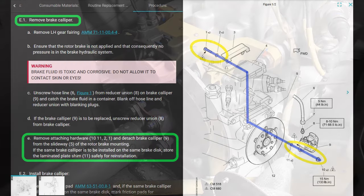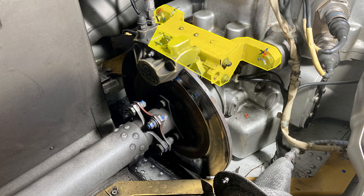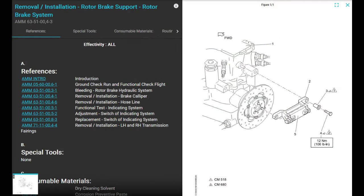So what you got to do instead of that is you just have to take off the support. That's way easy, okay? It's just the 2 bolts that hold the support into the transmission. 2 bolts with bushing. There's 2 bolts that hold 2 bushings into the transmission. So you just disconnect those. So now we have to go to a different chapter on how to remove and install that brake support, which wasn't on our original trail of maintenance manuals that we're working on. You follow me? It's super simple.